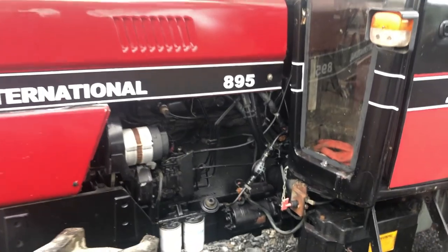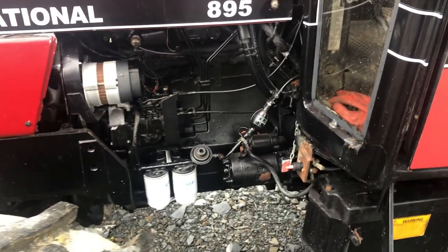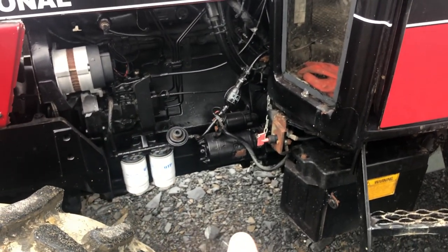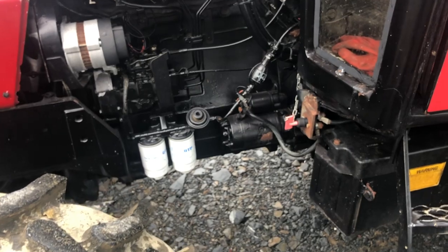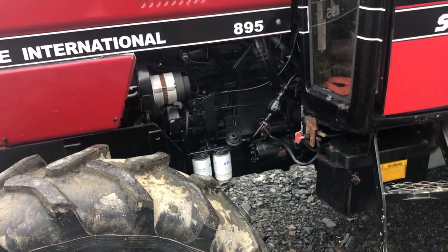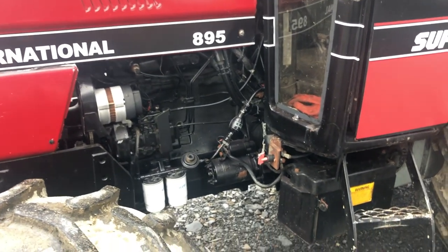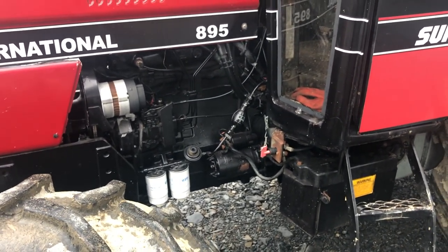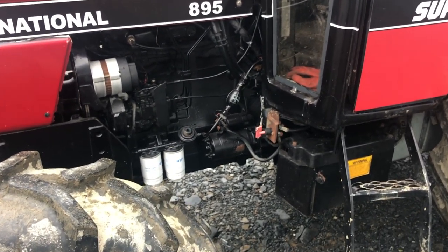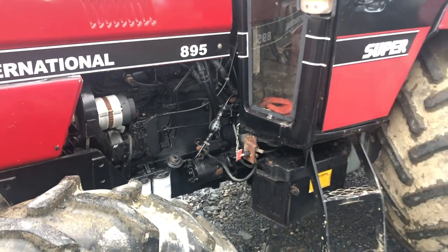I fitted another little buy here — she's a bit hard to start, so I fitted a little hand-squeezing pump for the diesel, just to pump a little bit more diesel to her in the mornings; give her two pumps. The starter is the original starter — can't believe it but it is. Works fine but she's a hard tractor to start. We checked the heater plug — it was fine and we replaced it anyway. So it's just a lazy starter. We'll change that for a high-speed starter; we did that on a 4270 that we had and it just made such a difference.